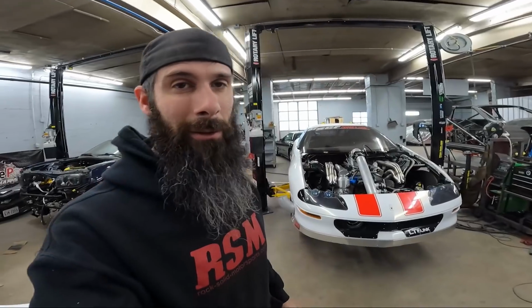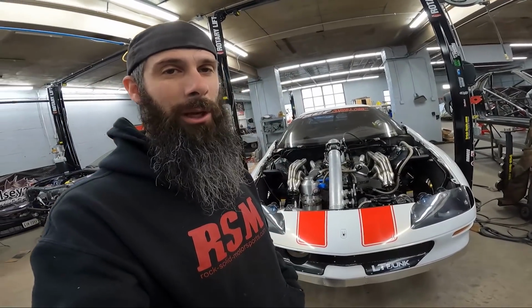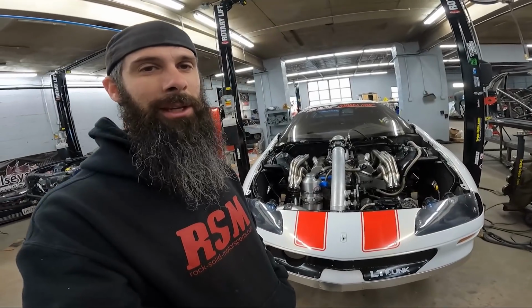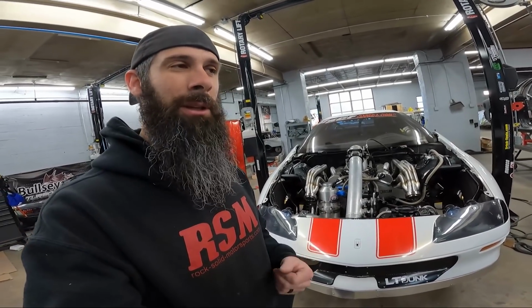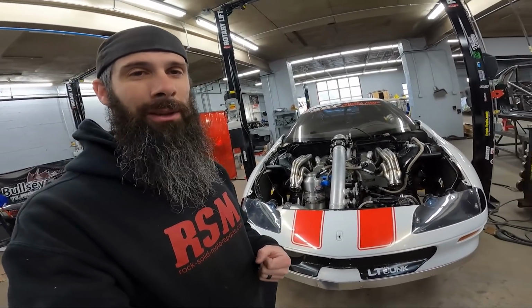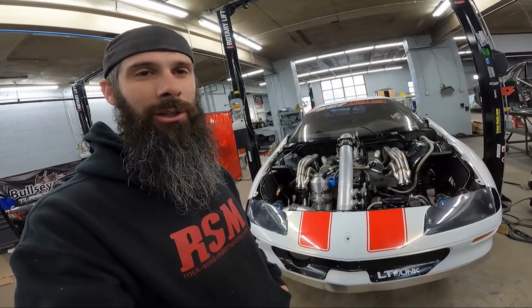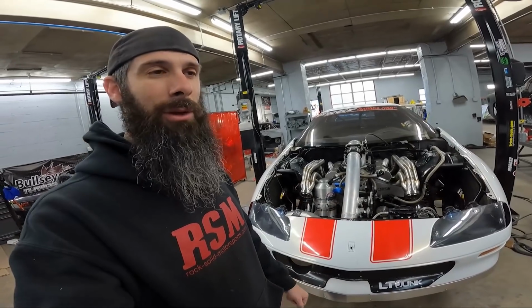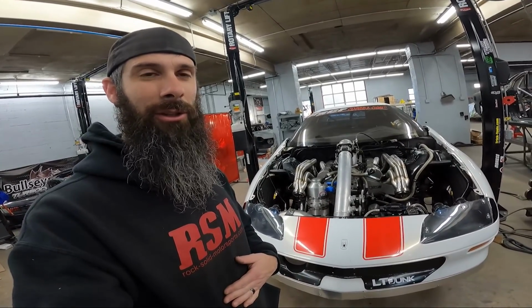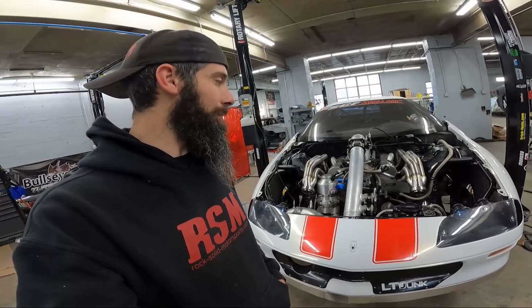Because we're not going to put any double slips in this year, I don't think that he'll have a problem with the flanges warping or anything as thick as they are now. So we're just not going to put something in there that's going to give him any issue, since we had those issues with the double slip. Double slip is fine for a car that doesn't leave and sound like an automatic 12 gauge before it launches. That's really hard on the piping, because when that fire is blowing out of the pipe and you hear the percussion of that thing hitting your chest when you're at the track, just think of how the pipe feels trying to contain all that.